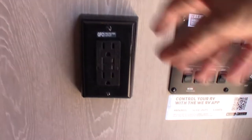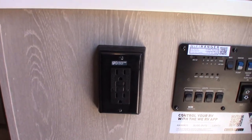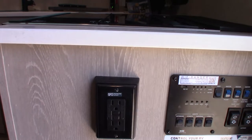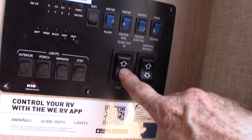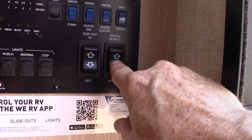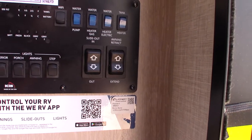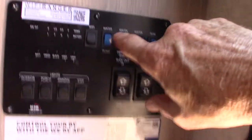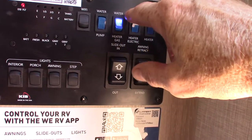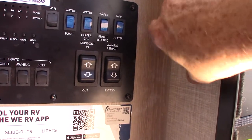Let's go inside. As soon as you come in the door, this is a GFCI plug — all the plugs in the trailer, even the one on the outside, are wired through this GFCI. If it pops from outside, you're still going to reset it in here. This is your control panel: here's your slide room in and out, your power awning extend and retract. Always leave the awning in when you're not around the campsite so it doesn't get damaged by the weather.